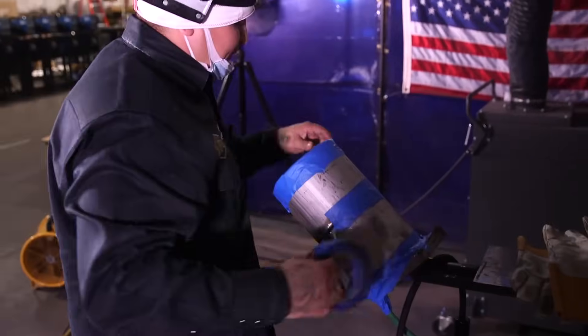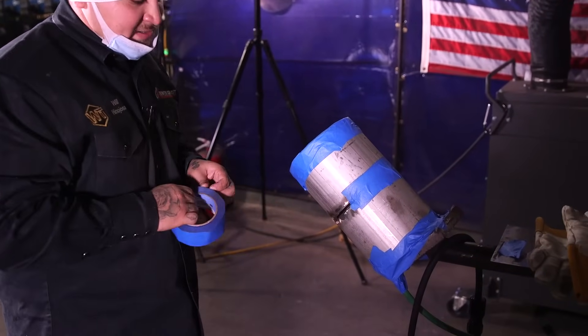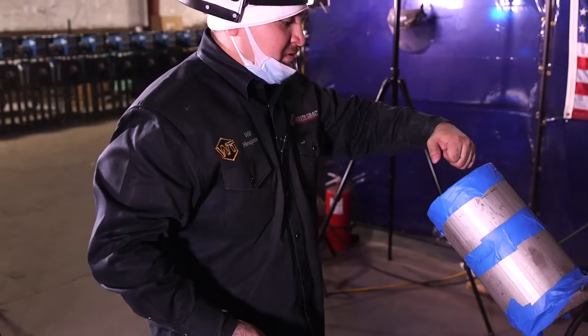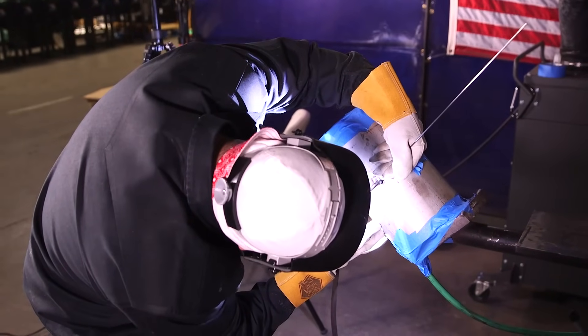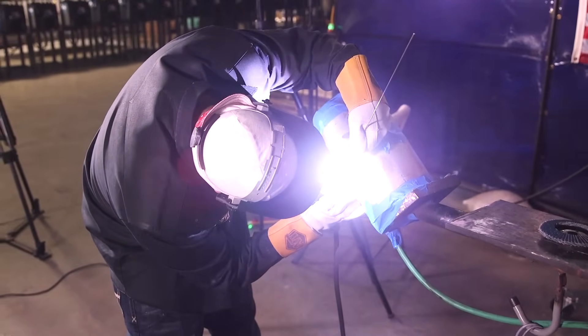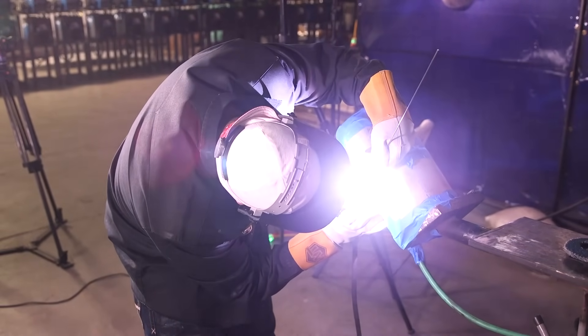After that, I'm going to re-purge it — take the block off the top, re-purge for about another 15 seconds until I feel a good strong purge up at my hole. Lighting up my tie-in: make sure you start behind it, let it warm up so it keyholes, and you can see it just like that. I'm just back feeding once to really get myself back to normal, then I'm going to go ahead and dip it — keyhole dip. I like this because I can see the wall being broken down, but you got to make sure you're pushing wire in there. You don't want a flat root.